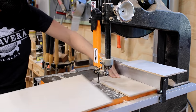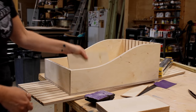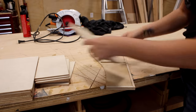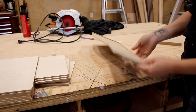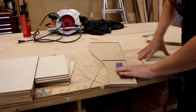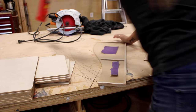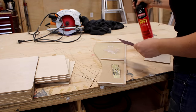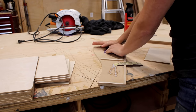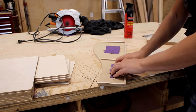I started by cutting some quarter-inch plywood at the bandsaw with the fence in place. One way to get the needed curve is to set the part in the drawer and trace the profile, then cut. However, with so many to do, I instead used a jig and a router table. I grabbed the template I made for the sides and glued some quarter-inch scraps to partition off the front and back, so I could take my quarter-inch square pieces and put them in these pockets, allowing me to trim off everything overhanging. I used a little spray of DAP's contact cement to attach a piece of coarse grit sandpaper to each section — this stuff virtually bonds any two materials together, and it helps grip and hold the part in place while I'm cutting it.